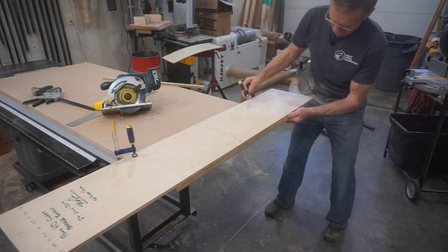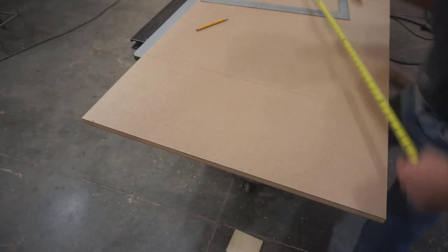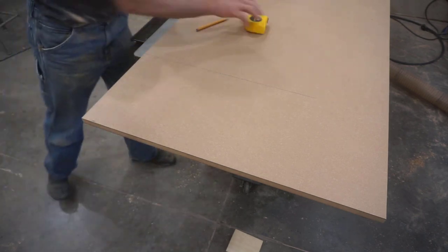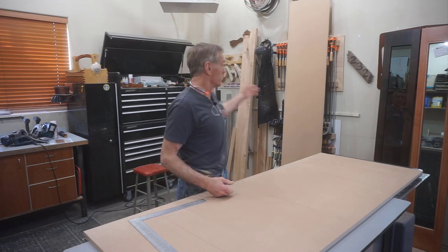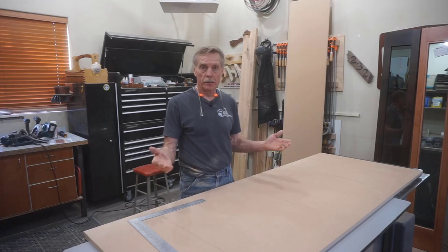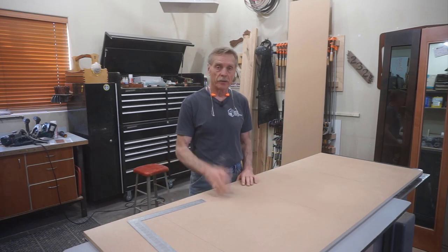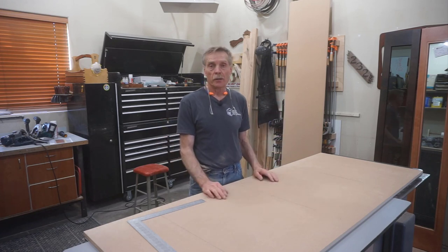As long as the edges of my sheet are straight and perfectly parallel, this end of the sheet comes out square also. I'll cross-tape the finished panel to make sure something didn't slip by unnoticed — eighty-three and three-sixteenths, two times. This process is so much more dramatic shooting video for it. All I'm really doing is taking a four-by-eight sheet, ripping it to width, trimming up an edge, squaring up an end, trimming and squaring another end. It's a very simple, routine process that happens with almost every piece of sheet goods I do. Setting up the camera so you can see how a big sheet is sized down into a perfectly accurate smaller sheet in a small shop is the point.